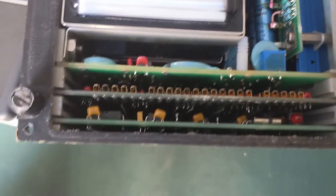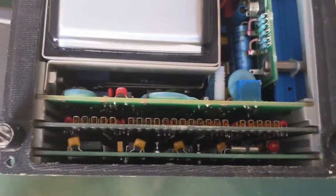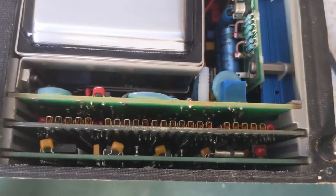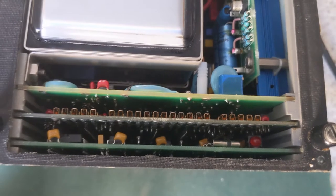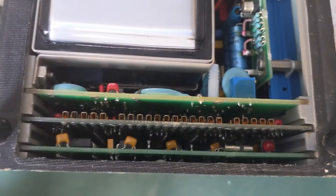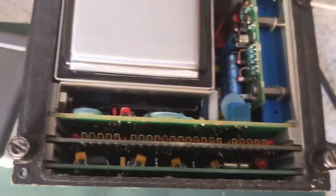It's a shame I can't get it to do anything. Either it's broken, or indeed there's some sort of configuration jumper setting. Looking at the firmware ROMs, there are a couple of options you need to set on the back panel. But the connector on the back panel isn't numbered, so I don't know which is pin 1, which is pin 2, etc. I'll just pull these boards out.